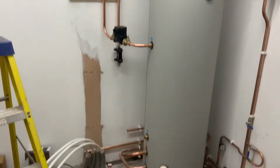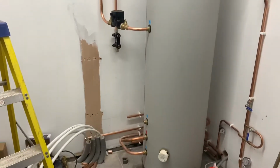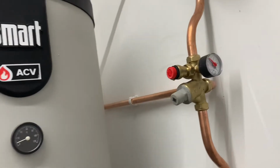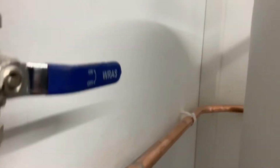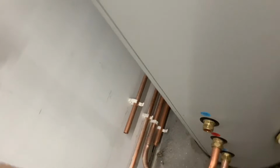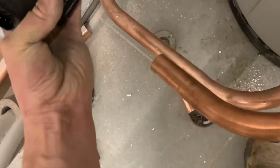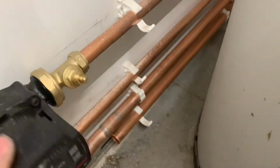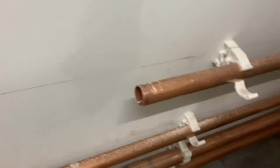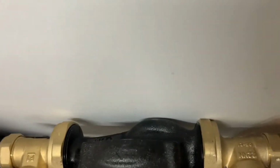And then Steve's put some tappings in. Got alt tappings in that, and prefab flexi hoses for outside. Oh, and then I had to bend that cold feed this morning to go around there with 45s on. Same with them ones, and I packed that one off. Steve's idea was to put a cut clip down, which has worked. So therefore the flow pipe will be further off, so that when you put a pump on there, there's a gap, because if you just use them normal clips at 3/4, you're just no good.